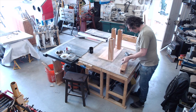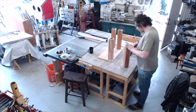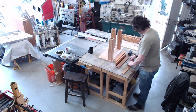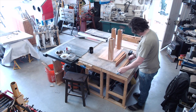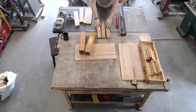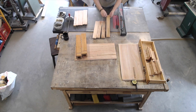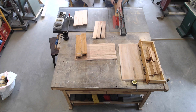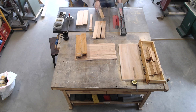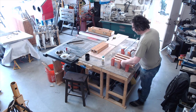It appears there's very little glue in there — it's all nail, this particular one anyway. Now the question is how do I join it. Essentially I'll get a good-sized table leg which goes in the corner. Two of them are built together because I only need the wood from two to make the legs I need. The nails are well and freely in there, so I'm going to run them through the saw just missing the nail to the width of the thinnest piece which has no nails, then clean them up and glue them together and they'll become the legs.